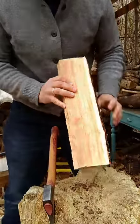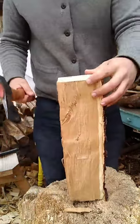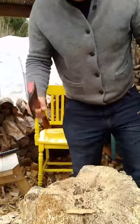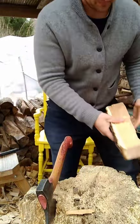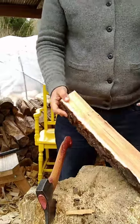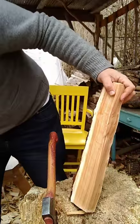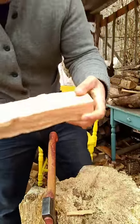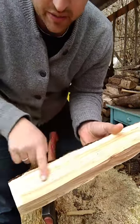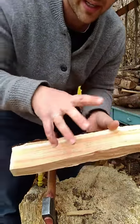If anyone has any questions, feel free to shout out. Neil, this is your spoon that I'm making right now. Just deciding how to orient it. If I have a choice, I like to put the spoon on the parts with the wiggly grain and retain the nice clear straight grain for the handle. It's easier to deal with wiggly grain in the bowl because you're already carving around.